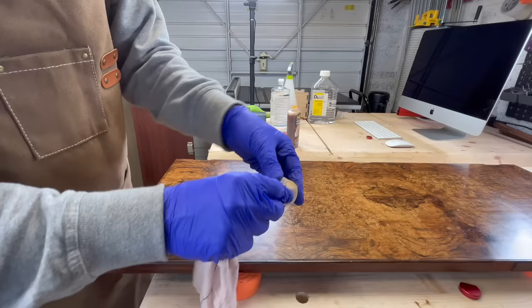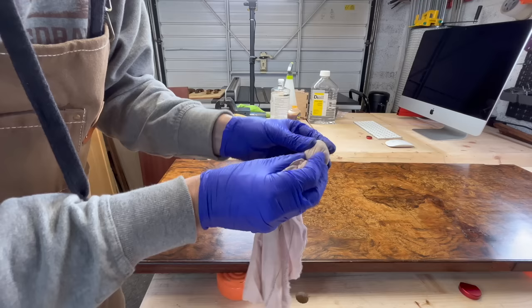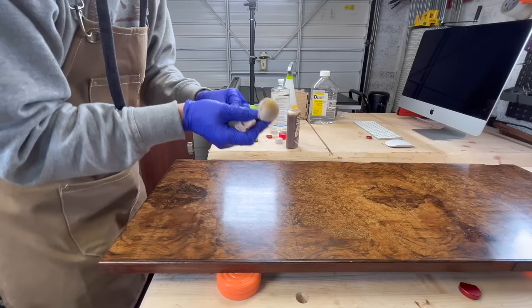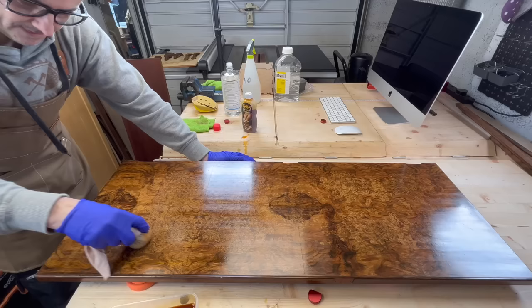So because of all the cracks and imperfections, and I don't know if you can see that, I decided to give it a few coats of shellac. And hopefully, if this is shellac, it will melt into the existing finish and fix it. I've never actually used shellac on anything, but this is probably the easiest finish to use.